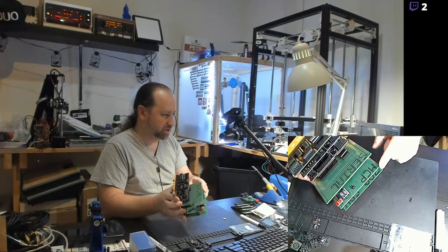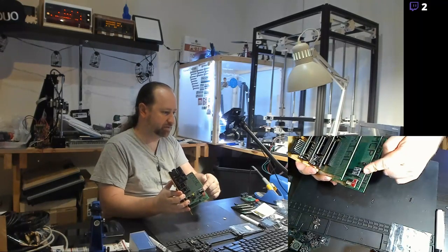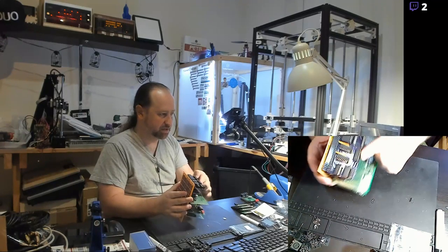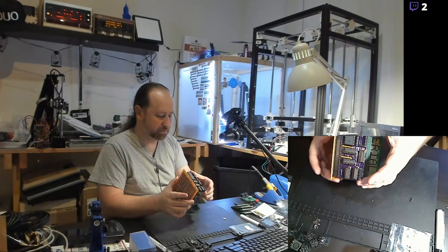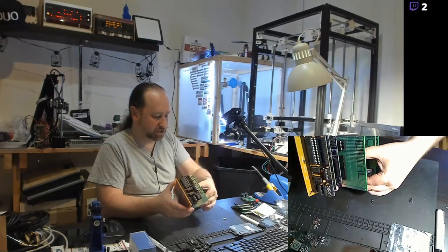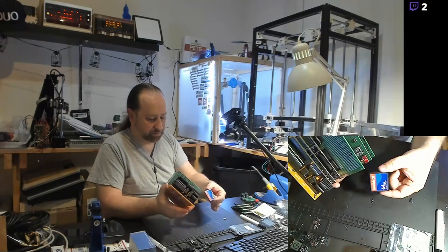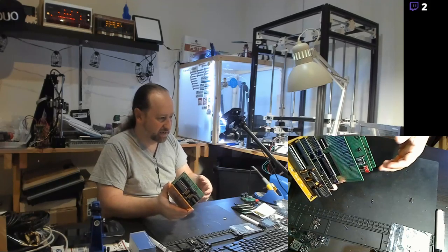The MCP card is a Raspberry Pi interface with a serial port interface, so the Raspberry Pi can act as a terminal and a standard serial card. There's things on here like a 512K RAM ROM board that was a kit that I bought, and a couple of other items. There's actually a compact flash interface buried in the center there. Soldering up the compact flash was a massive pain in the ass.